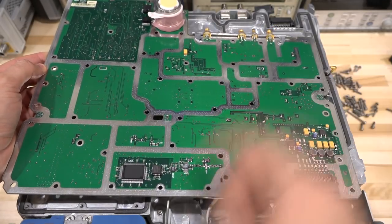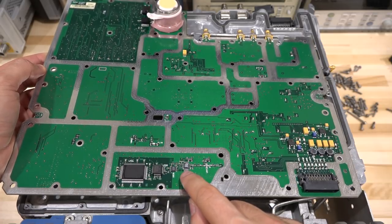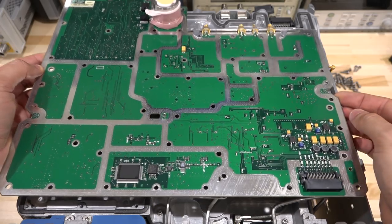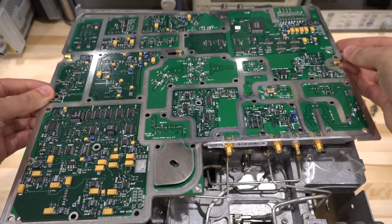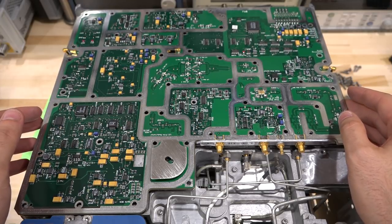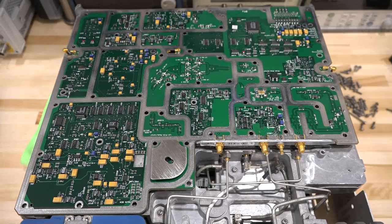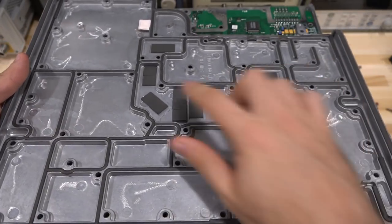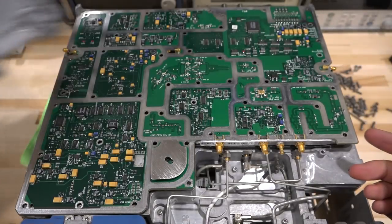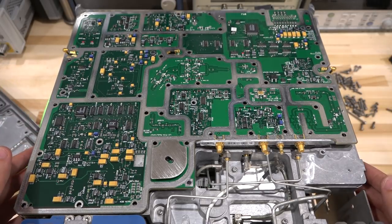There are some customized ICs here which are part of the PLL — some fractional PLL — and that's going to be difficult. This is the part I replaced in the previous version: a divide-by-two or divide-by-four. This is a Hittite/Analog Devices part. Instead of digging in right away, for those who might have forgotten how this works, let's take a quick tour of the block diagram to remind ourselves what we're looking at. On the back of the top metal case you can see strategically placed RF absorbers and thermal pads — not to be mistaken with one another. Very nice design as always.